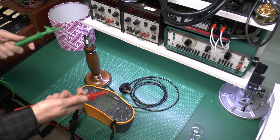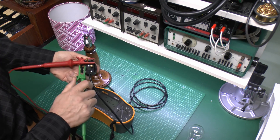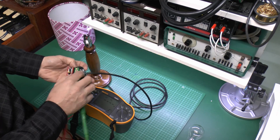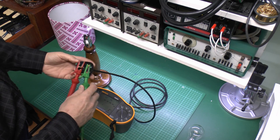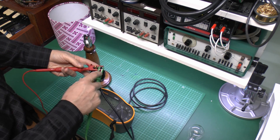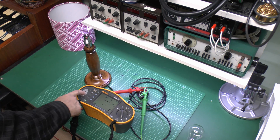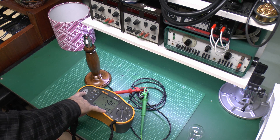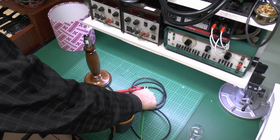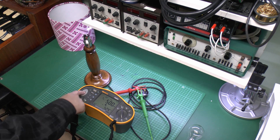So with this one, we take the two leads - the red and the green ones - and check one onto the actual earth pin. Then we can either check between the line and neutral separately, or just connect between the two pins and apply the test voltage. In this case there's nothing actually connected, so we can do it one at a time. If we place it between the earth and the neutral and press the button, the voltage is 524 volts and we've got the insulation resistance as greater than 500 megaohms - so that's perfectly fine. You'd normally do that between earth and line as well, and pressing that gives pretty much the same result.